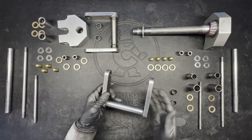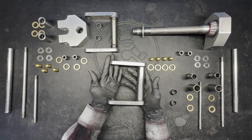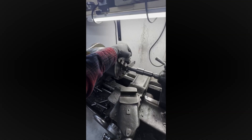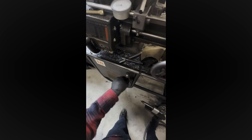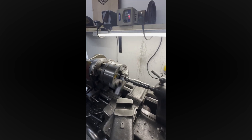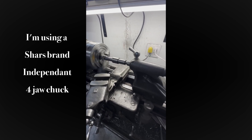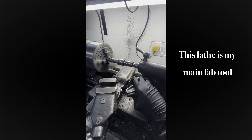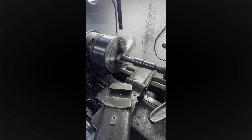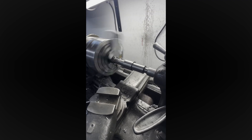Now I'll move on to these three-piece pivot arms — upper and lower — and they're almost identical. I took some flat bar, cut it down, welded it together, and used these annular cutters that I cannot recommend highly enough, chucked up in my lathe tailstock, so that I could drill through and get a very accurate hole across the left-to-right side of the bike. My lathe is an old South Bend Heavy 10 — I got it pretty recently, it was a bit of an upgrade from my last Atlas, and I'm so in love with it. It's so smooth, cuts great, and I love the auto feed. This project was actually my first opportunity to start practicing cutting threads.